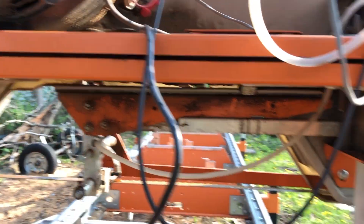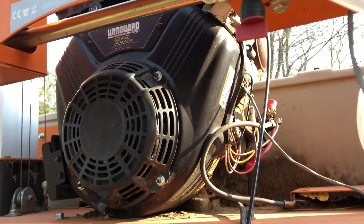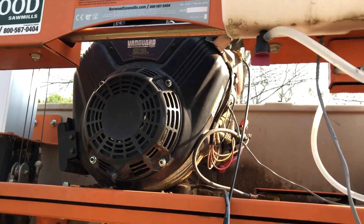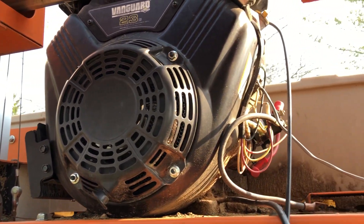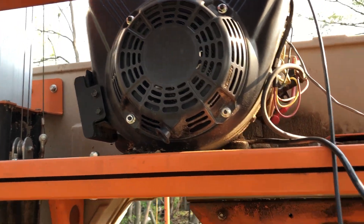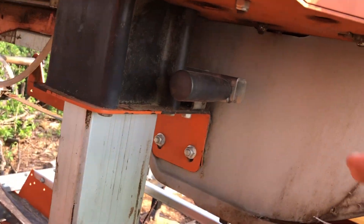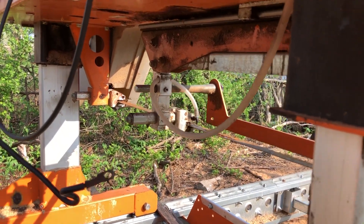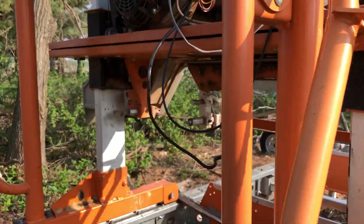So that's one thing to automate. Next is the throttle itself going into the motor — probably using some sort of RC controller. I also want to automate motor starting and the choke, though I may just add a manual control on the machine to start it and warm it up so I don't have to worry about automating the choke. Another thing I'm looking at is the blade guide, which moves in and out based on how wide the log is. I want to automate that too, though I'm not sure how yet.